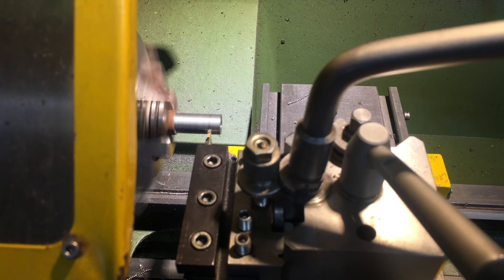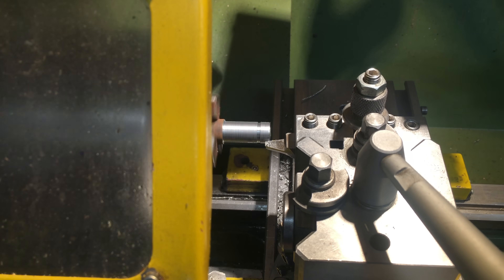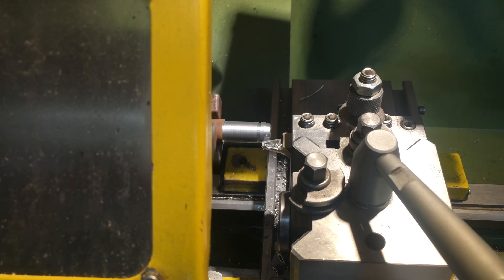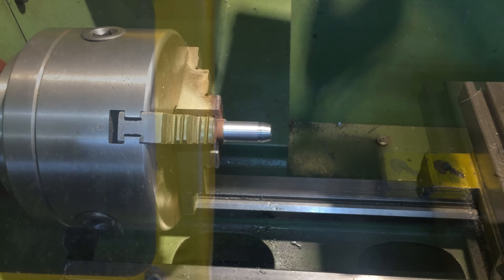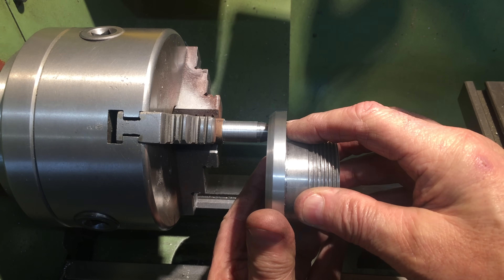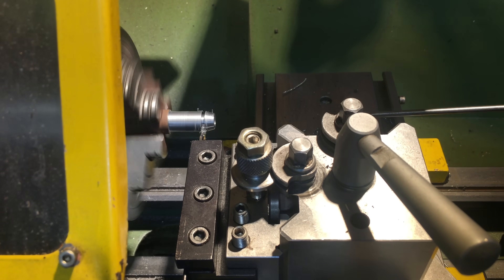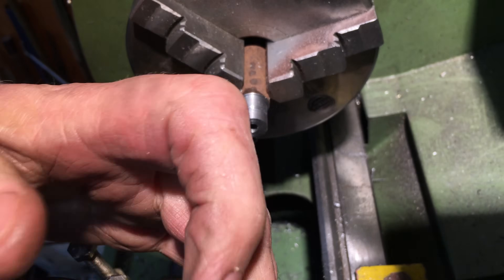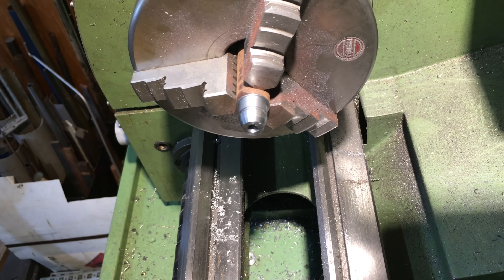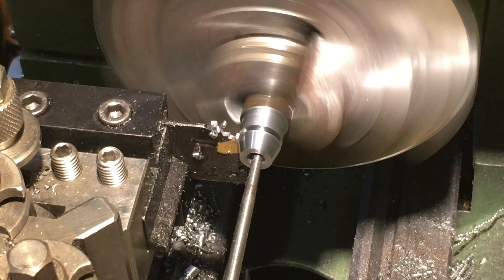The idea is to simply cut a small groove for the moment and part it off later. I then set about machining the taper using the tool I made when the other cutters were done on the Clarkson cutter grinder. I machined the taper until the witness just disappeared. If I've got my figures right the small end of the button should just snag in the dovetail of any one of my arbors. Lady Luck was with me and I could part off my first one to check the fit. But for now I had the arduous task of doing this 15 times more — I don't think I need all of them but better to have a few spares.